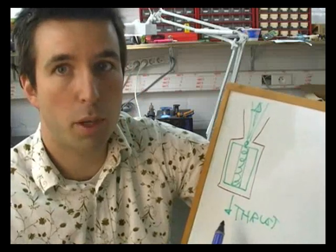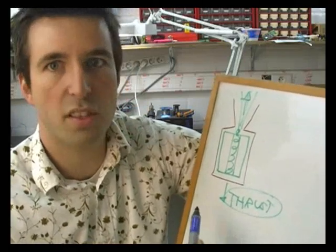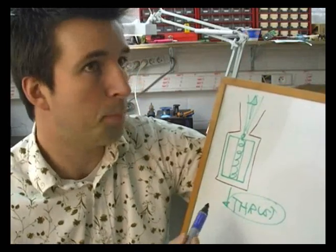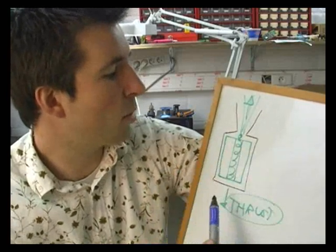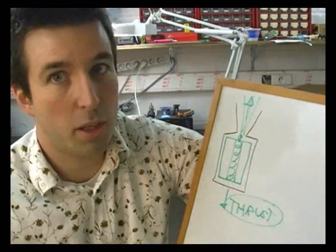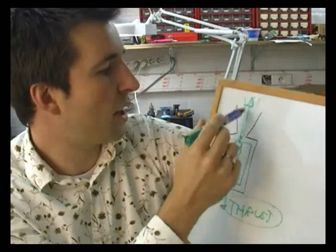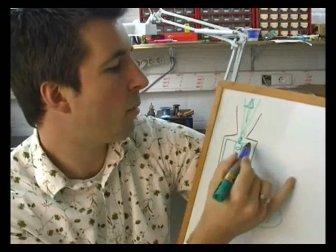One of the main properties we're looking for is the thrust of the motor, because this is what ultimately is going to propel the rocket skyward. But in order to control the explosion in the motor chamber and keep it at bay, make sure that the motor doesn't explode but that the gases can still vent, is the pressure inside of this motor. Now this we can measure as well.